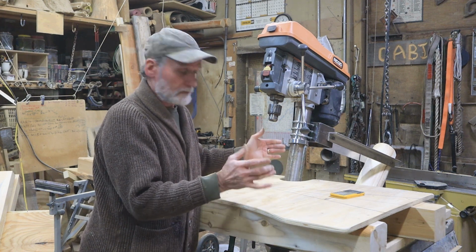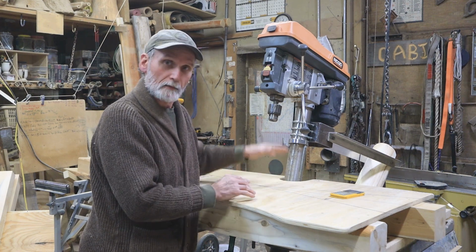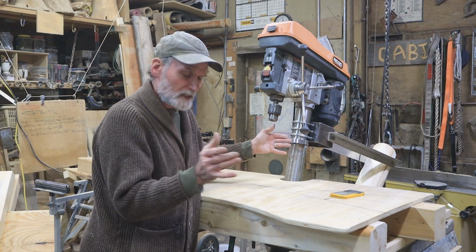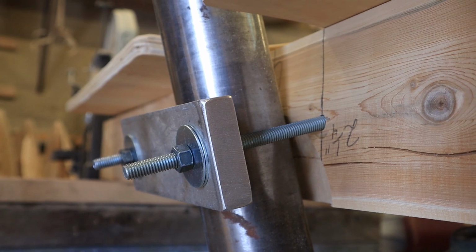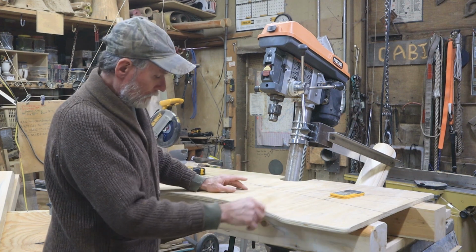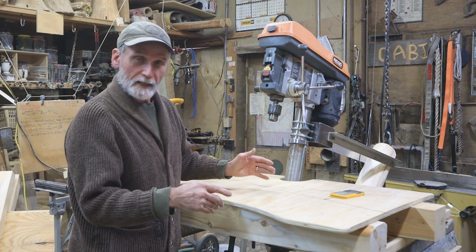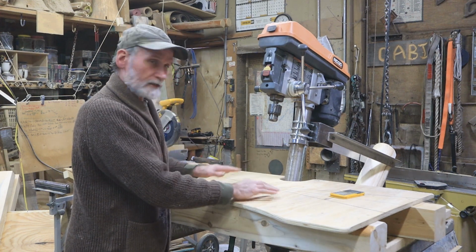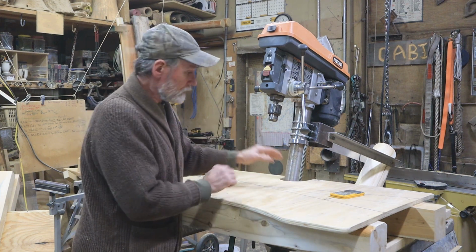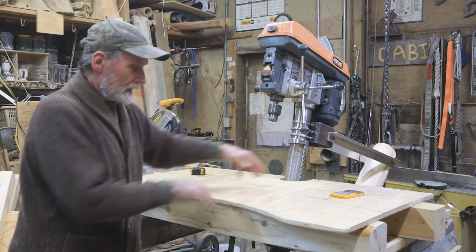There would be ways around it, but we don't have to find a way around it. It's going to be spot on all the time at the 15 degrees as it goes up and down the column. It's just a nice little perk. So, bolts on the back, we put wings on it, we're using spacers underneath of it. We added on the base to have some tension, because I don't want to use a bunch of stuff to fasten the tabletop down. I want this to be able to come off in a minute and switch to something else, so it's very fast. There are just 2 nuts on the back. They come off to take this off.